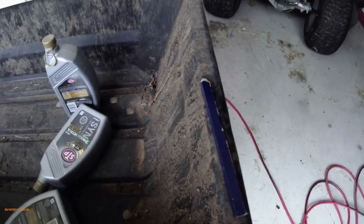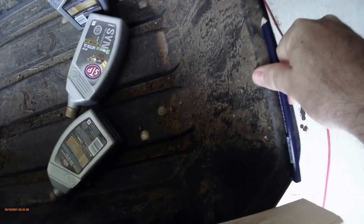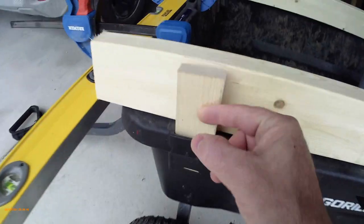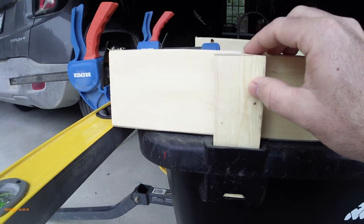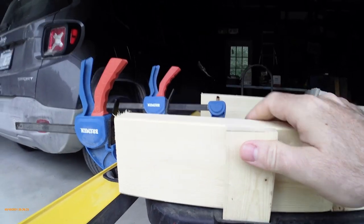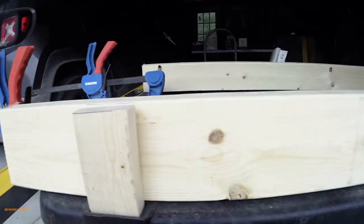And the overhang here, because I'm going to put the board in the middle, helps rest on the frame here. Same thing with back here. It'll rest on that. Some of the weight will rest on this as well, I should say. And if you wanted to know, these are 5 7/8 inches tall, if you want to build one as well. You can see it's fairly flush right there. So my method wasn't the best route, but it worked.